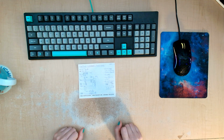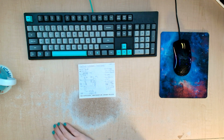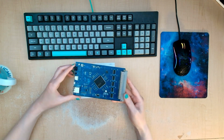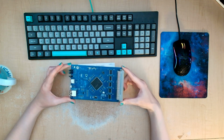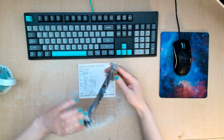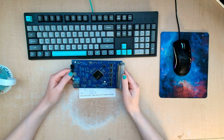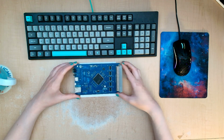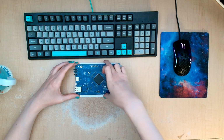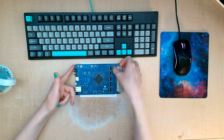But that kind of quickly devolved into the form factor I'm dealing with here, which for reference is this. That's the size of the card for a Euro card standard size 3U that plugs into a backplane. Given this size, a RAM stick will not fit vertically, and a RAM stick will fit horizontally, but I won't have a lot of room. I think it ends up being like to here.